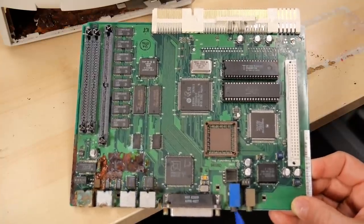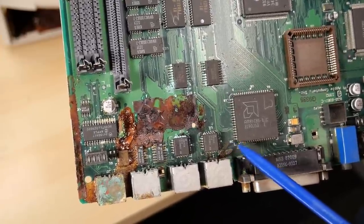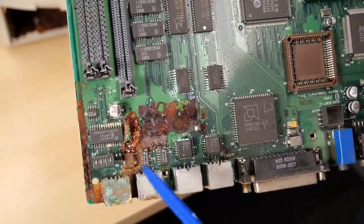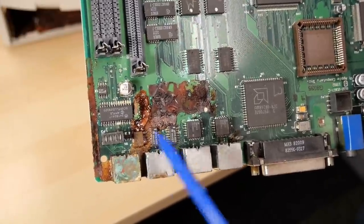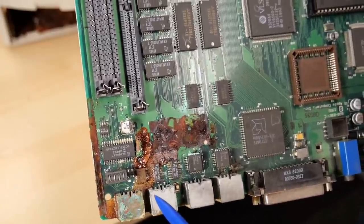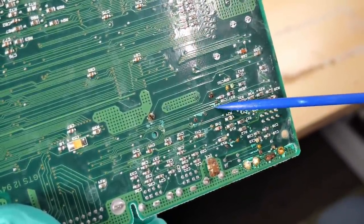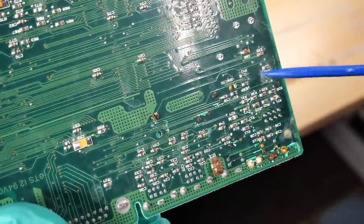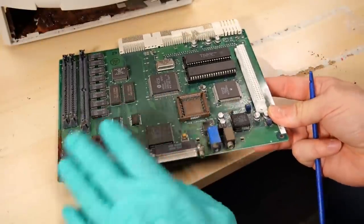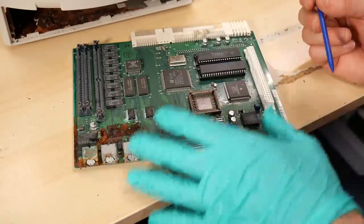This is the other problem that might have killed this board. There seems to be what looks like a dead fly right here — sort of hollowed out and dead. These are the two serial controller chips; they might be bad. What is worrisome are these two ports — Apple Desktop Bus ports — which I assume is probably this chip right here. If these aren't working, well, it kind of makes the computer unusable. On the back of the board, this is under the section where the battery leaked, and yeah, there's quite a lot of a mess here. There definitely might be some eaten traces and other problems with this board, kind of like that original Classic motherboard with the leaked battery. It was very unlikely I was ever going to get that working — I actually ended up sending that out to someone who's reverse engineering these boards to try to make replicas.